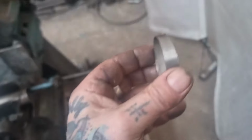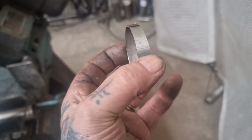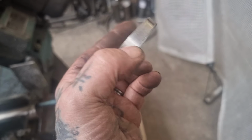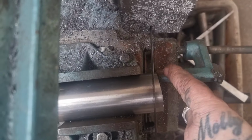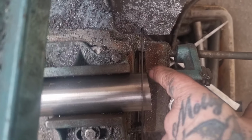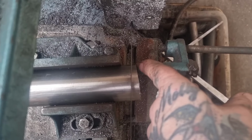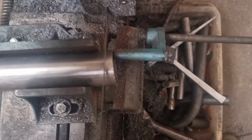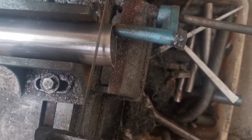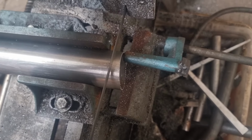Right, I've cut one, I've cut the end off that. But that's not a true pie because this side's flat, because it was the original end of the tube. It's not angled, but it's a useful piece. What I've also done is set my stop. So we're going to make them all the same length, and we can make them bigger or smaller. Don't want to go too small because you'll end up too tight on this joint, but that'll give you a bigger or smaller curve like when you're doing your 90.